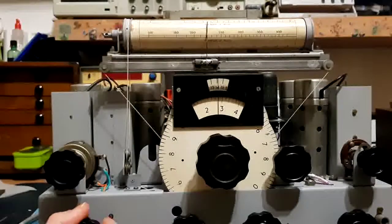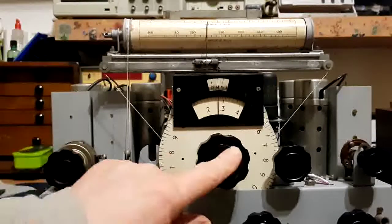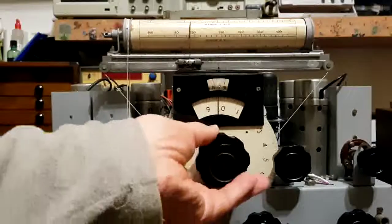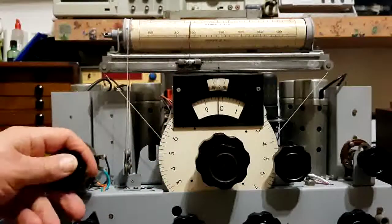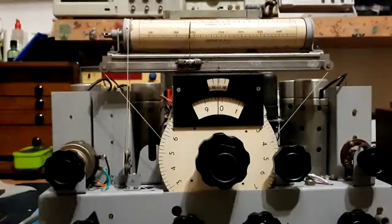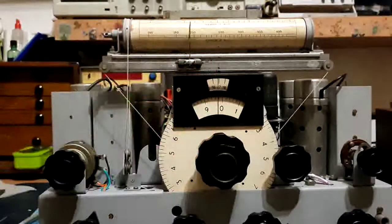Put that up to 6 kilohertz bandwidth for the filter, to get better audio. Slightly off. What is it about, 198 I think it's supposed to be. Even though I tune the band ends at 160 and say 400 on this, the points aren't exactly on each one of these. I think I said it in one of the other videos I made.